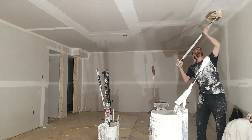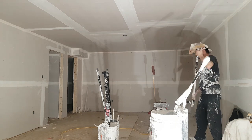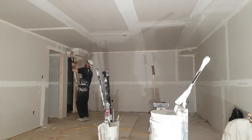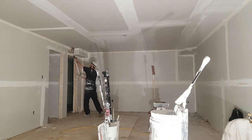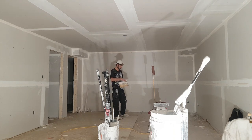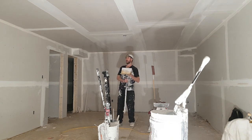You're building it up. And when the butt joint is really small — like maybe above a door — I'll just run it down the center. The next coat I'll do by hand, because it'll turn out much better and it'll be done. Compared to with the box — I could run a 12-inch box on it — it won't be done.